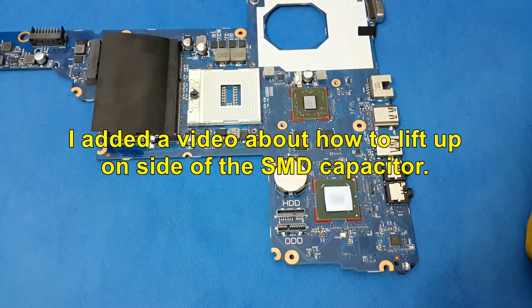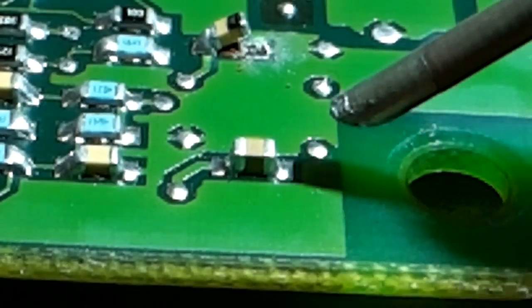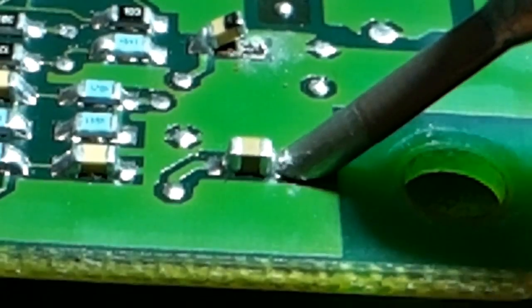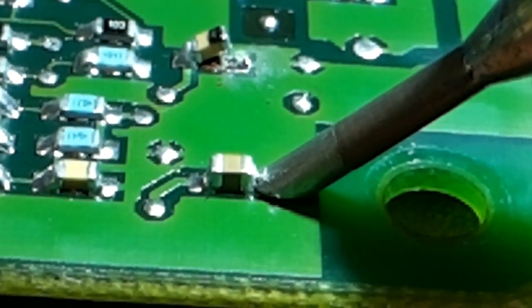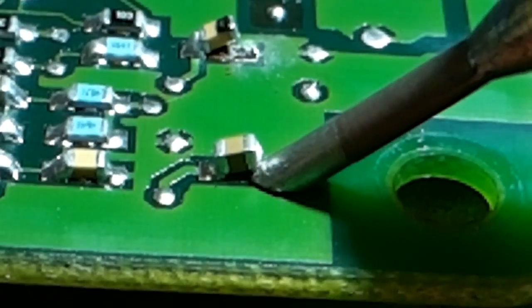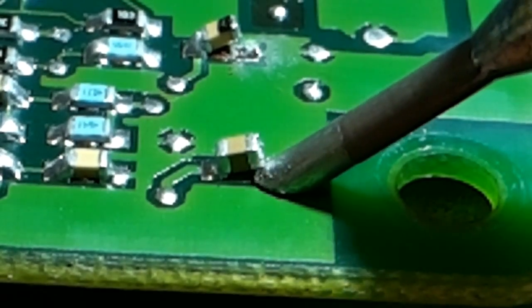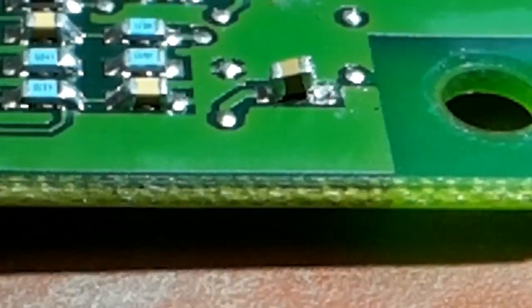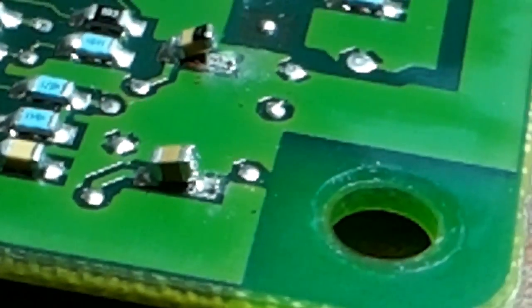Remember, it's not always about capacitors. Any electronic component on the motherboard could be bad — one or more than one. It could be a transistor, a capacitor, or an IC. We have to find a way to identify the bad component. The main problem is when a capacitor or resistor is not totally bad — they test good but are not working fine. Even with these complications, we got it. Thanks for watching the video — if you like it, don't forget to give a like and subscribe.